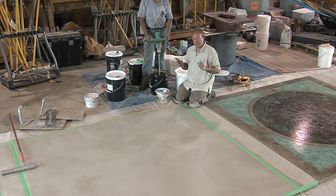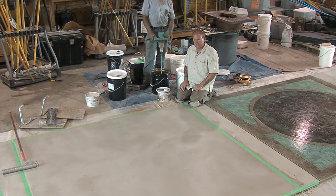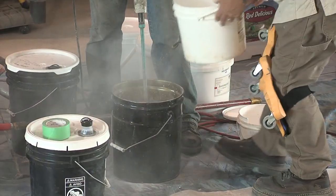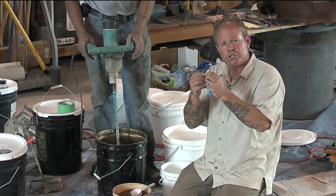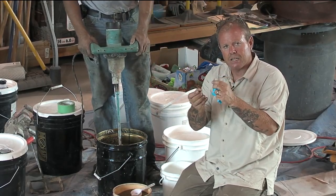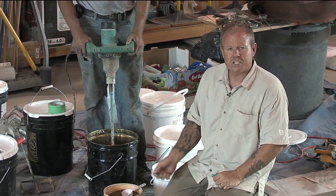I put it down with a roller — it's called a turbo roller — that basically has little ridges in it for dispersing it across the surface; it acts as a squeegee a little bit. Metal buckets are very important. We don't like using plastic five-gallon buckets because inevitably, depending on your mixing paddle, it'll start to shred the bucket as the paddle at high RPM goes around hitting the side of the bucket, tearing little shreds of plastic off.